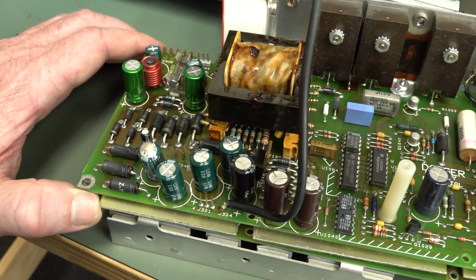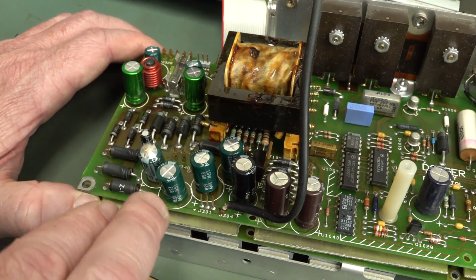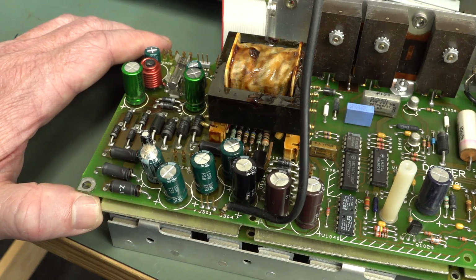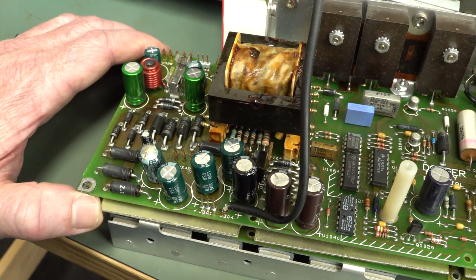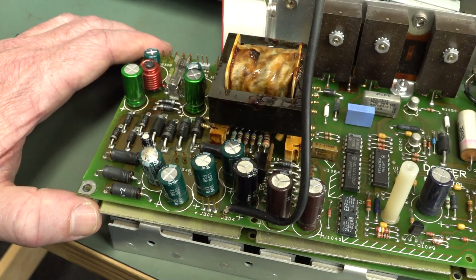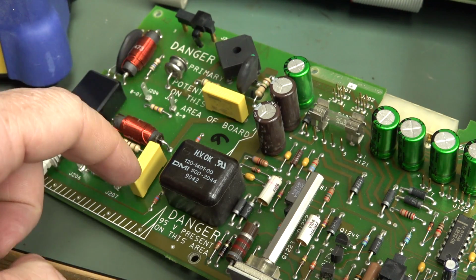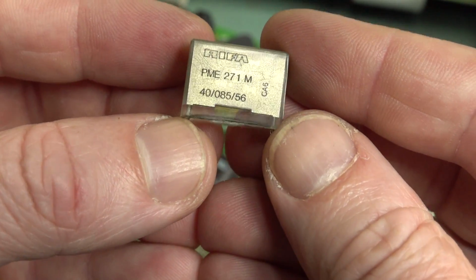Brilliant. Yeah, lucky I've got another one. Anyway, yes, these are One Hung Low brand low ESR caps I've put in here. I don't recommend you use these long term, but as you can see, it does work. The scope now powers up and we got out of trouble. Except I put it in backwards. Oh, anyway, I'm going to go in there. I'm going to replace some of the X caps as well while I'm at it. There we go. Got 2 new X-Class caps on there. Nice. So, and there you have it.